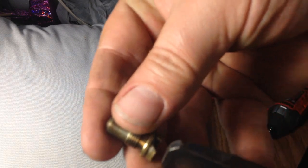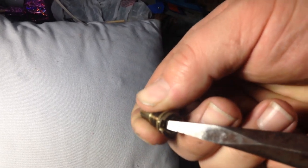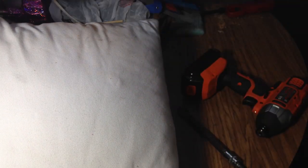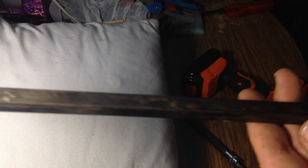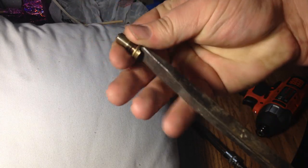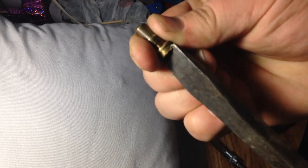That's what I came up with and it worked real quick. The main thing is you have to make sure your chisel or screwdriver is blunt enough that it fits just tight in the check valve with no play. People say they use a big old screwdriver — this one is about two feet long, a big square screwdriver.